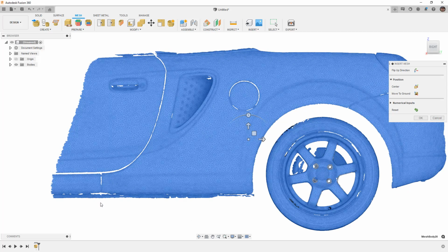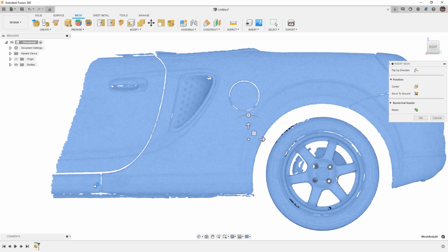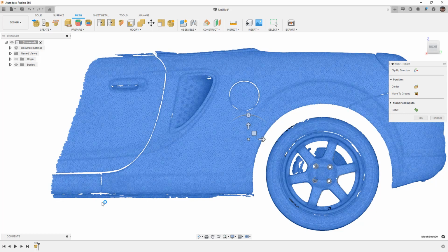Now, if you've not really done any body work on cars or spent a lot of time working on cars, when we see seams like this going into what's called the sill or the kick plate area, this is generally what happens when manufacturers weld large panels together. Now, sometimes a portion of that will be plastic. You find this a lot of times on the roof. Manufacturers have gotten really into including like a strip that seals the weld gaps and things like that. In the old days, what they would actually do is use lead, call it tinning, and they would actually sort of fill in the areas where those are.